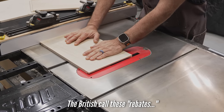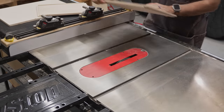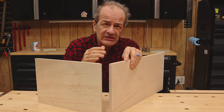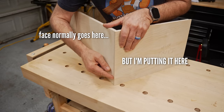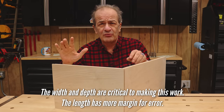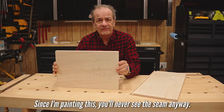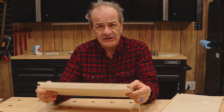There are lots of construction techniques for drawers, but since I was planning to paint this, I figured there was no need to get fancy. Simple rabbets for something like this are more than good enough. Dovetails or drawer lock bits are fun, but they wouldn't add any strength or stability here. When building a drawer I usually like to cut the rabbets into the sides, which ensures the seam will be covered by the drawer face. However, in this case I was more concerned with maintaining precision in the width.